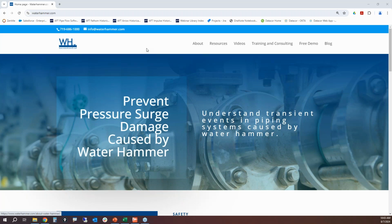Anyway, there are lots of videos on YouTube that you can find that demonstrate what Waterhammer is, and it can be a real big problem, and it can cause pipes to shake. It can burst pipes, collapse pipes. It can cause damage to pressure sensitive equipment. It can damage the pump seals and bearings at the pump connections. Definitely something that you want to avoid.